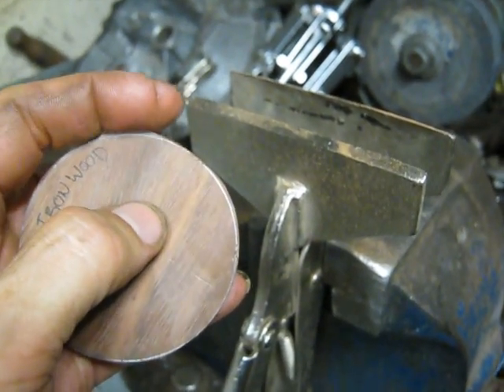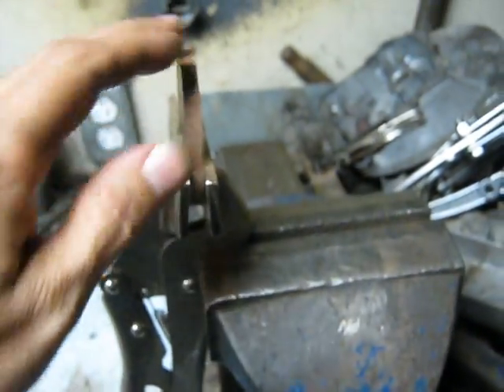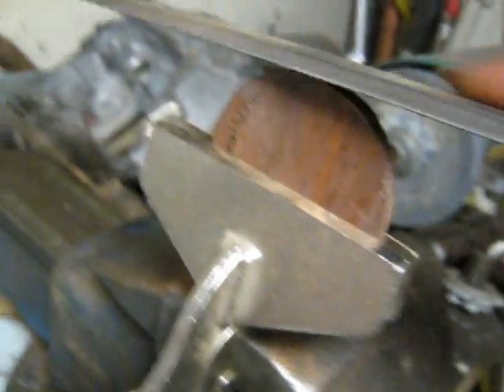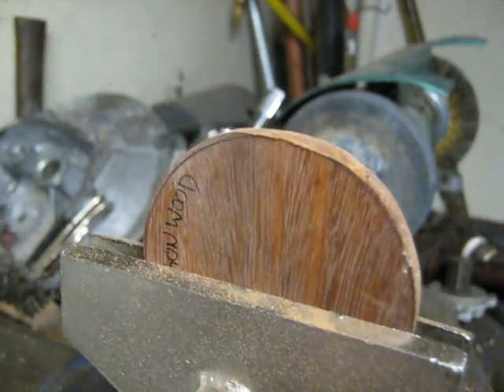I was just going to show here — I have to file it down to a circle that I've drawn on it. I've got a pair of sheet metal vise grips, so I just clamp it in there; that way it gets me 90 degrees to the vise. Then I've got a real coarse file that I just file it down. I've filed some aluminum that seems to be softer than this ironwood, so I guess it's kind of living up to its name.